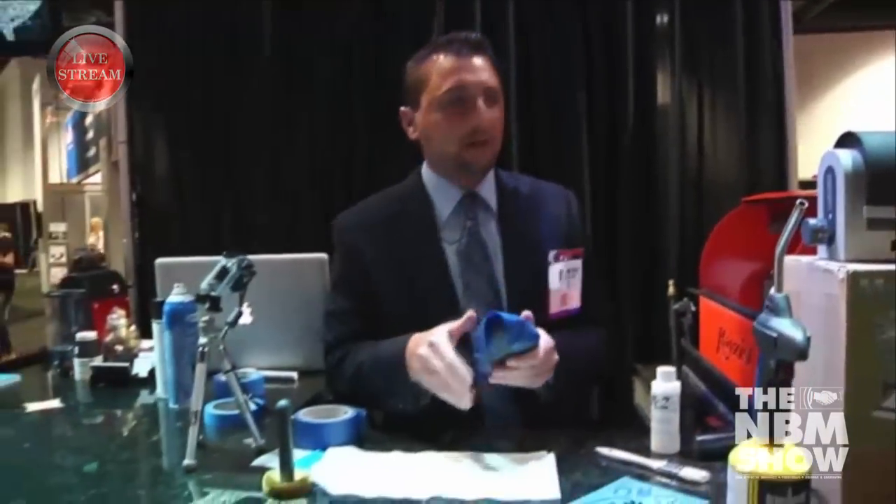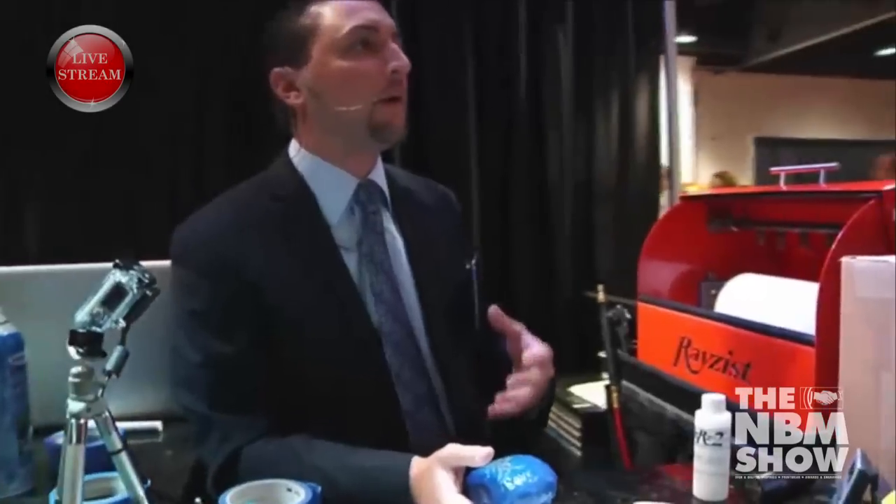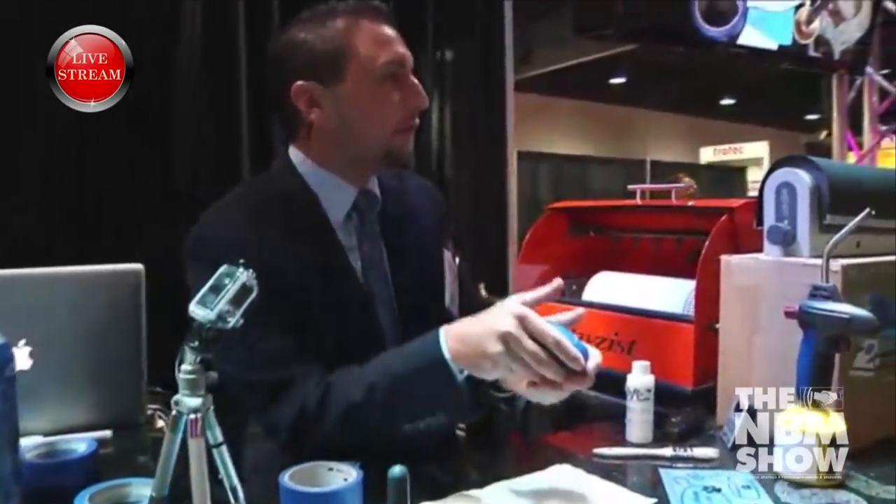That's a great question, Nick. I'm going to be using 150 grit, which is the same grit I'd be using with glass. Now if I was doing rocks only, I could do a 120 grit, but I wouldn't want to blast glass with a 120 grit. So 150 is good for glass, good for crystal, and also good for rock — it'll just take a little bit longer.